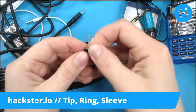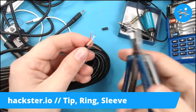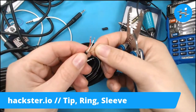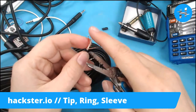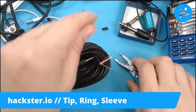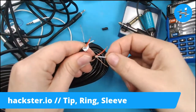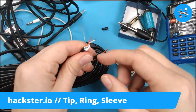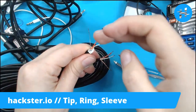So you want to make sure that you're not using a really tight fit on your wire stripper so that you don't cut that ground wire. And you want to make sure you have plenty of that. Second thing to be aware of is that sometimes there's like an enamel coating on these. Like these are both shielded in plastic mostly. But you'll also see ones on smaller systems where the internal wires look shiny.